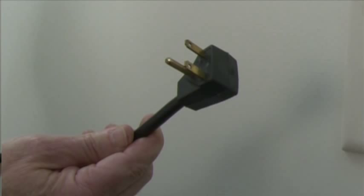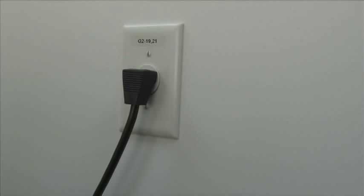The main power supply for the rotary glass washer is 208/230 volt, 60 hertz single phase connection. It comes equipped with an approximately six foot plug — you simply plug it into an outlet. It has a 220 volt style receptacle. A NEMA 6-15 amp receptacle is the proper breaker size for this unit.